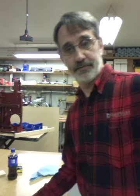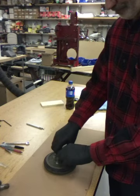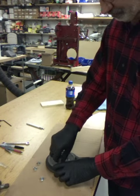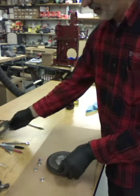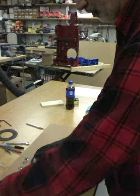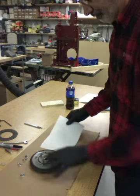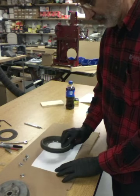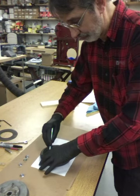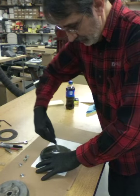Let me tip this camera down and show you what I'm going to do. We're going to take the cover off — keep these four bolts/nuts. This cover we don't need, get rid of that. This friction disk, you don't need that anymore, get rid of that. What we're going to do first is take a sheet of paper, rip it off — that's plenty big. Put your clutch on top of that upside down. Now take an exacto knife and go around on the inside of this hole and cut that paper out.